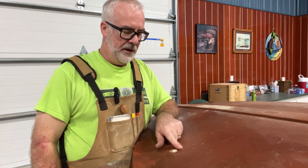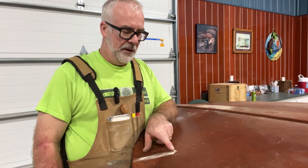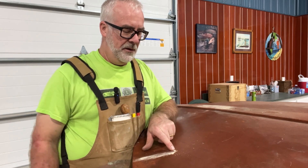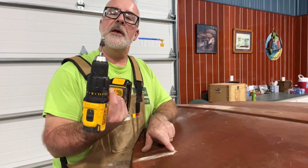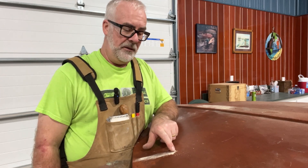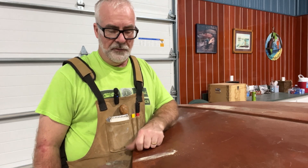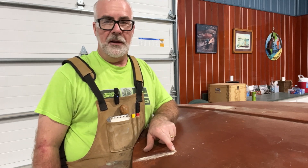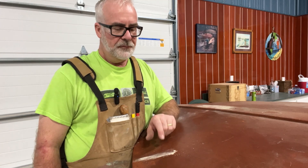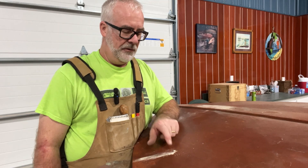Right there — I've cut the varnish, I've cut the stain, and I've gotten right into the hole. If you get it right in the middle of that bung, which is not too hard to do, just the tip of that fuller bit will ride down into it. These are Phillips heads, or Frearson even, so that helps a lot. If it was a slot, it should still hit the slot, but maybe not as easy.